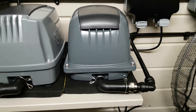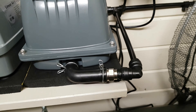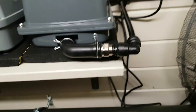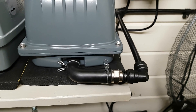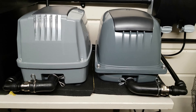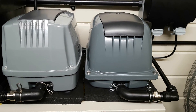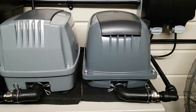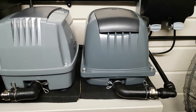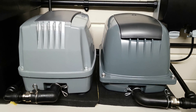So we've got the new pump up and running, plumbed in neatly with 12mm MDPE and 12mm hose with 12mm push-fit fittings. Overall it's a little bit quieter than the ET80 and putting out a little bit more air. Hopefully when it wears in and breaks in a bit it will get quieter as well, just as the ET80 did when it was brand new — it made a hell of a racket.